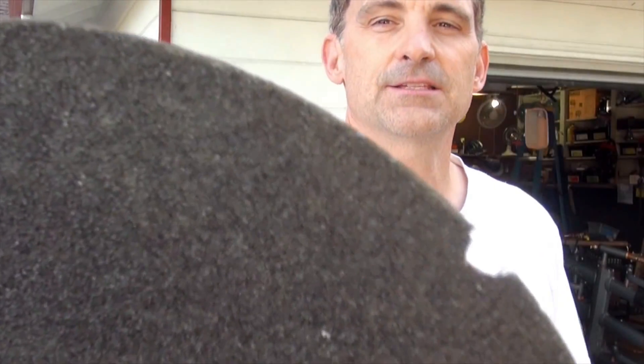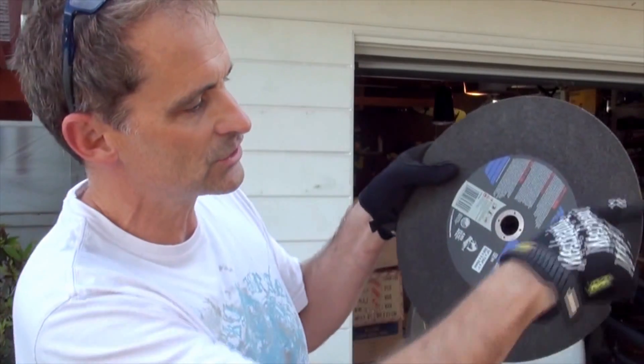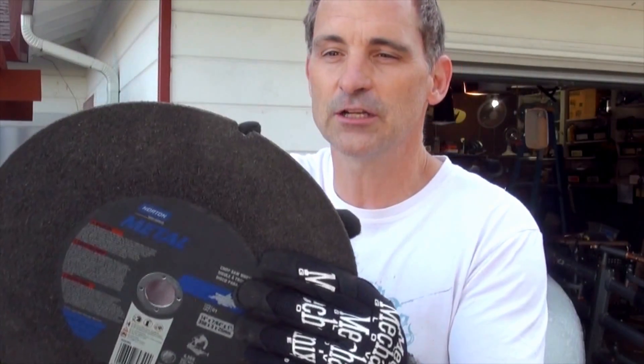So here's what happened. I got a little ways with chopping up pieces of steel — I got quite a few and I'll show you in a second — but then what happened is this: you see that? That is a divot, a chunk taken out of this blade. What you don't ever do is use a chop saw blade when it's got a chunk taken out of it, because this thing gets to spinning very, very fast. What happens is if you get energy going into the thing unevenly, the waves of energy will kind of go around it, and the blade will just kind of explode. I've seen them explode from across the room — just instantly decompile — and it's spectacular and fun to watch, but you don't want to be anywhere near it when it happens. So as soon as you see a little chunk like that in your saw blade, you need to throw it away and go get a new one.